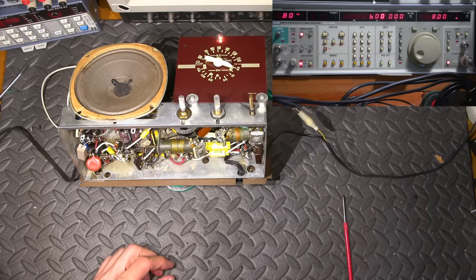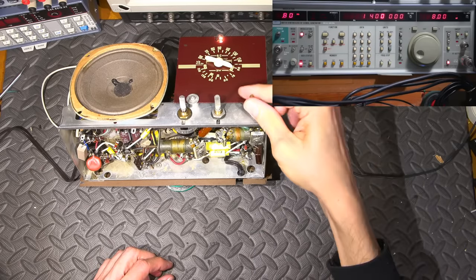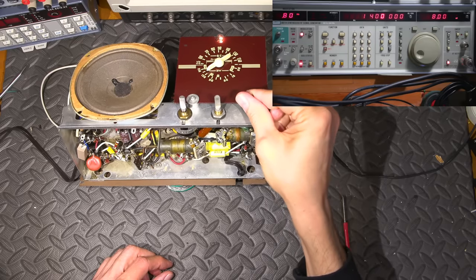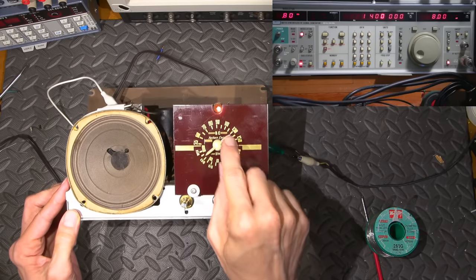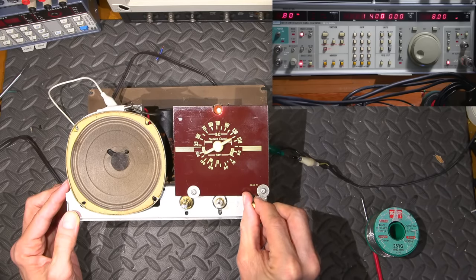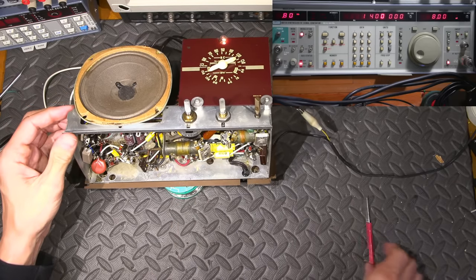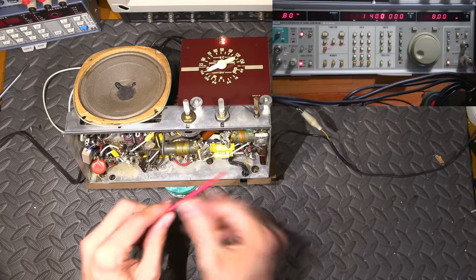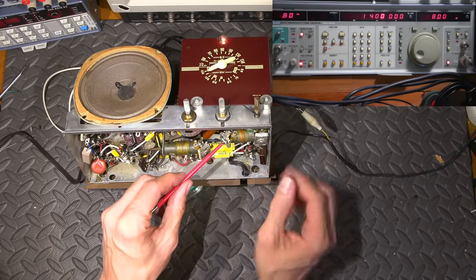So now we need to go back up to 1400 kilohertz and see if we can hear this back up at 1400 again. Now you see how it moved that down? That end is now moved down. So we need to go back up to 1400 again and readjust the free end. We've got to go back and forth and back and forth until that reads in both areas. And at that point, the dial should read very close.